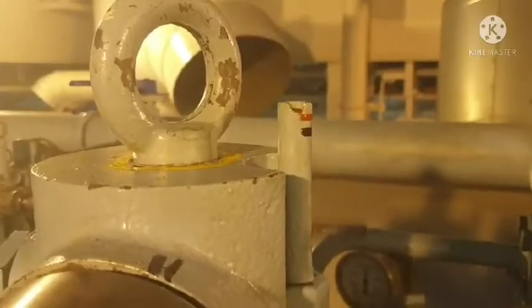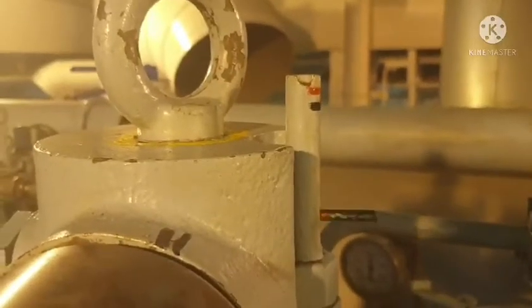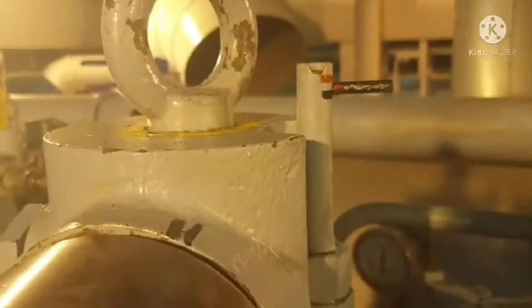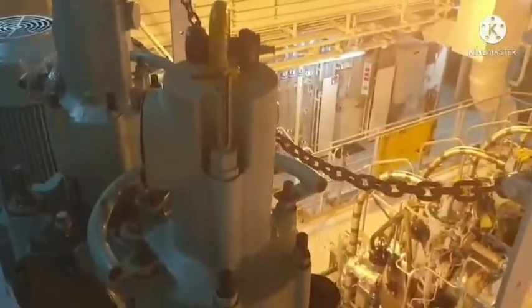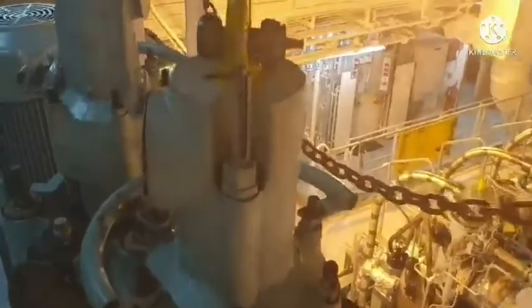At this point, being the engineer checking the valve rotation, I would say that the valve is turning. But here comes the question: why did I say that the valve is turning when I only observed the up and down movement? I will now show you something — let's have a look at one of the spare exhaust valves where the rotation indicator is also present, and we'll open the top assembly and see what's inside.